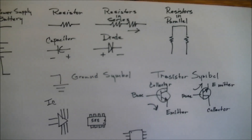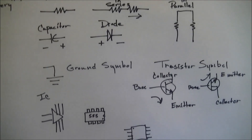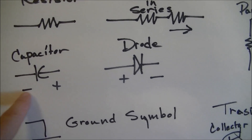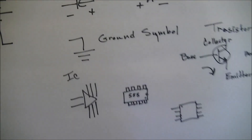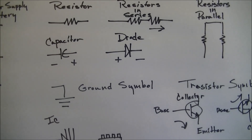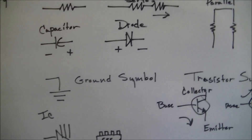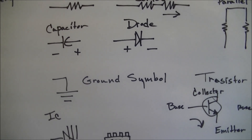That's just some basic schematic diagram symbology, but take notes on this stuff. I went through it fast, but I showed you current flow — current flow is always from plus to minus, positive to negative. Series, parallel. Later we'll put some of these things into application by making a couple of small blinker circuits. Then we'll make a couple of small fader circuits and we'll use a resistor and a capacitor to get our RC time constant, which will control the rate of fade on your fader circuit.